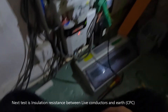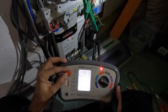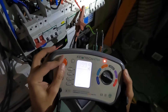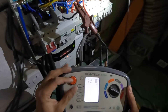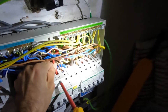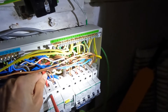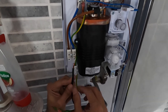Now we're doing insulation resistance testing — applying a voltage to the wire to check if all the insulation is okay. It's clear between line and neutral. I did a line-to-earth test but because it's got a parallel path it's still a good number, as it's connected with all the other CPCs. Earth to neutral is reading 199. The reason for the lower reading on the other CPC side is it's still connected at the bar at the top. Connect the line wire back, and the neutral back into the correct side, put the lid back on — we know the wire is okay to use.